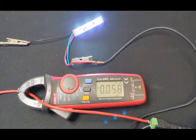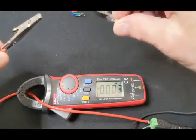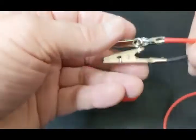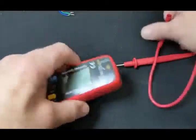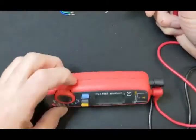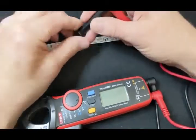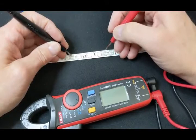We've got to check continuity — let's do that quickly. Make sure you always unplug your power brick first, because if you touch the positive and negative exposed leads together while it's plugged in, you'll short it out. So be aware of that if you're working with exposed leads — you might want to get some that are insulated. Let's turn it on and plug the test leads in.